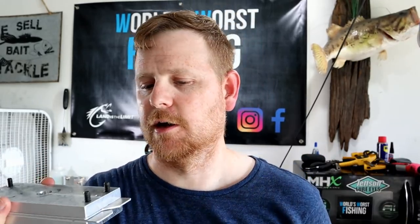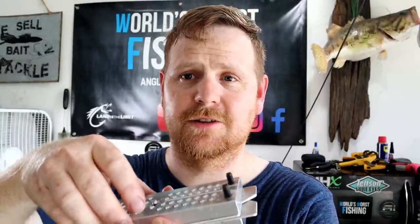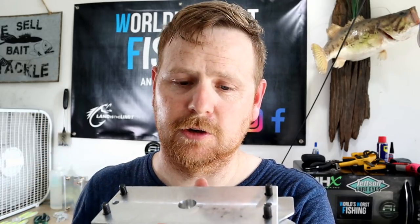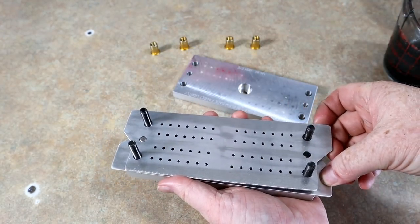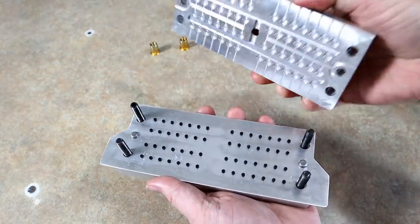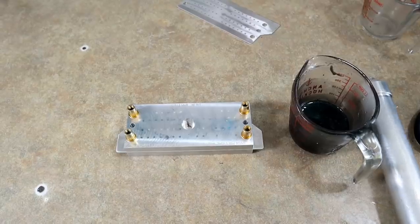This mold definitely requires attention to what you're doing - you don't just lay it out and run it. It needs to be done in the right order: cavity facing up, run the pupil color first, then take the plate off, flip it, and fill in the rest of the eyeball. You need to do that even with a solid color, or else you will run plastic in one side and out the other, which is potentially dangerous. Remove that top plate, remove just the middle plate, leave the bottom plate, and safely set the plate in with cavities facing inward.